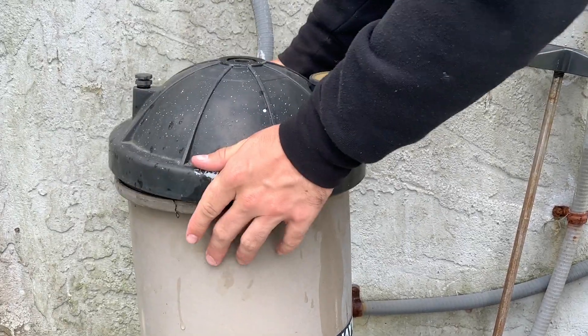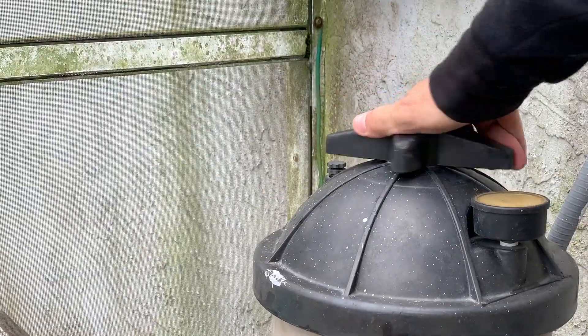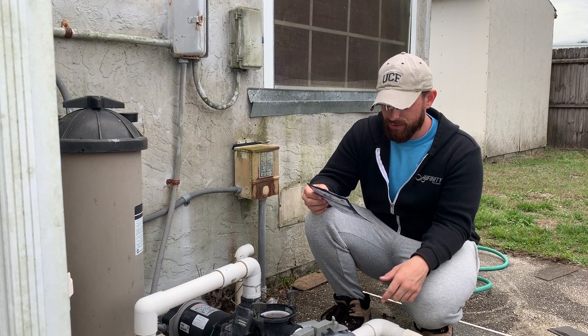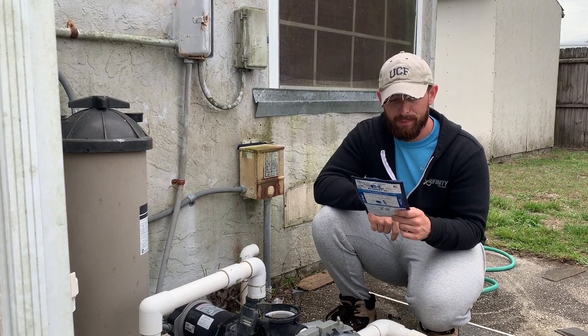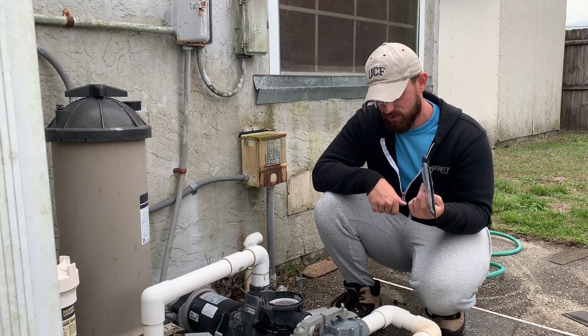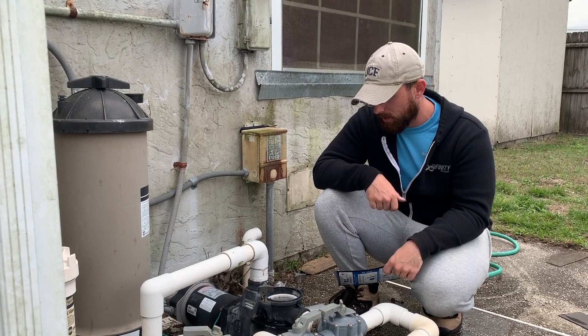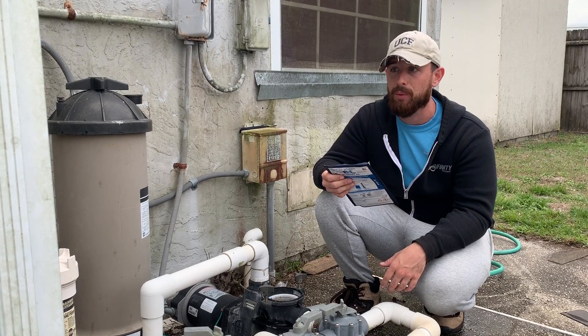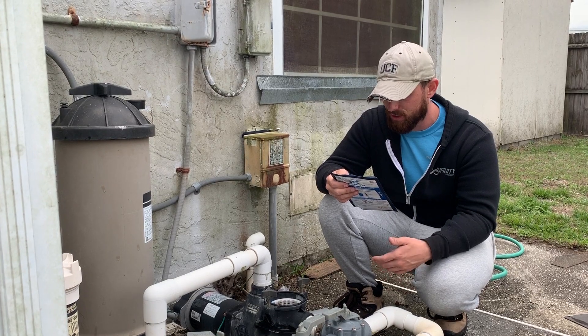The filter has been serviced, now it's time to put it back in nice and clean. Then I'm going to put the minerals in. Just double-checking all the directions for use: clean filter before installation — done. Add the ionizer cylinder to the pump or skimmer basket — done. Pour the minerals into the pump or skimmer basket — also done. Then run filtration for one to three hours to fully dissolve the minerals. Wait an hour before swimming — no one's getting in today, it's about 55 degrees outside, so that won't be an issue.